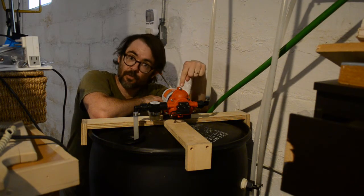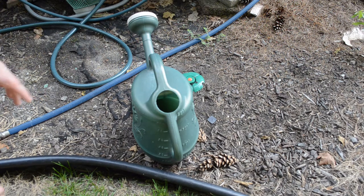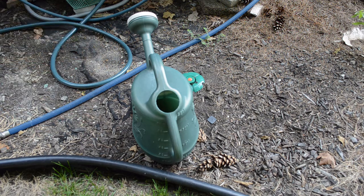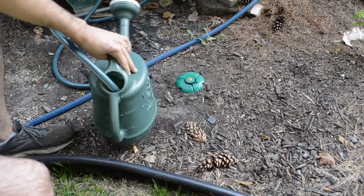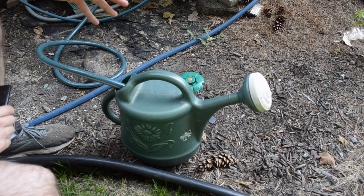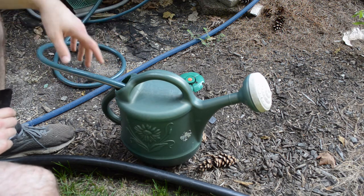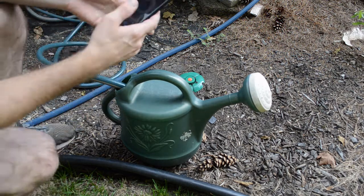With that in mind, let's go do Mark's tests and see how this stands up to the city water pressure out of the yard. We're going to try a couple tests here. This watering can holds 7 liters. I've got my house water on this hose. We're going to time how long it takes to fill up to 7 liters to get a sense of the flow. I know you can buy flow meters, but I'm not going to buy one just for this test. So I'm going to start the stopwatch on my phone when I open the spigot.